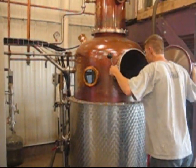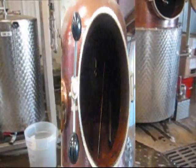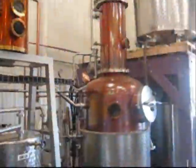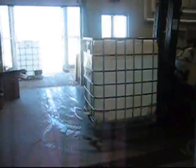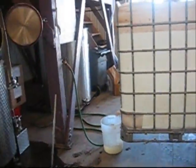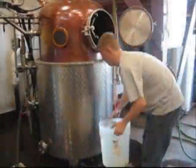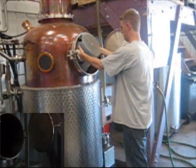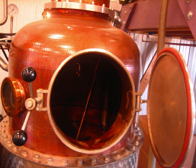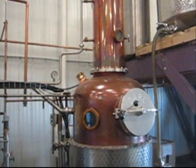This particular pot holds up to 100 gallons of liquid, 80 of which are below the door. Rinse the pot. The ethanol mix must be brought into the production area. Measure out the desired amount of ethanol mix and pour it into the pot. Next, measure out fermented apple juice to add to the pot to enhance the flavor and the aroma. Using the system controls, add in water.